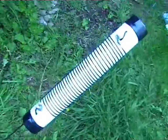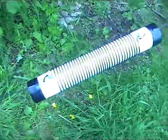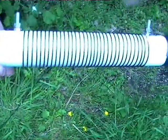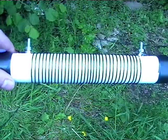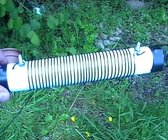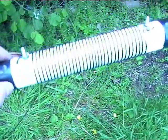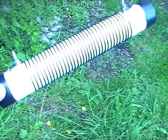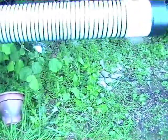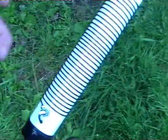Here you can see one of the loading coils for my 40-meter dipole. The overall length of the antenna is about 48 feet. I made these coils this morning — I've had some problems with the dipole itself, I couldn't get the full length in one straight line so I had to dog-leg it a bit, and I had problems with VSWR. I know a lot of people frown on loading coils, but initial tests seem okay. I've run the full 400-watt legal limit through it on 40 meters and they seem fine.